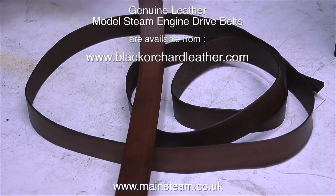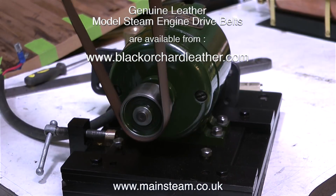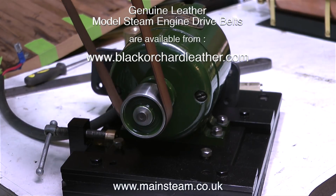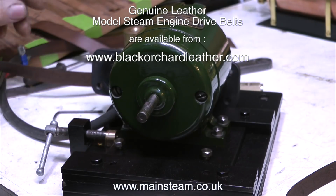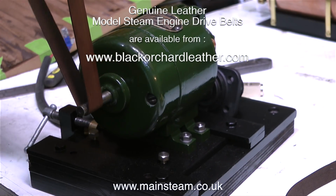And if you've been watching my videos recently, you will notice that I've just rebuilt a small generator and it's ready for testing. I think possibly the pulley is going to be slightly too large, but I'll try it to start with. The leather belt fits okay. It's 5/8 of an inch in diameter, which is a bit on the small side for the size of the flywheel of a Stuart 5A that I'm going to test this generator with.